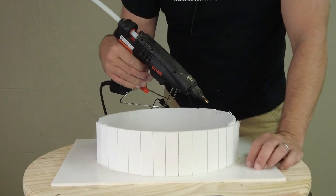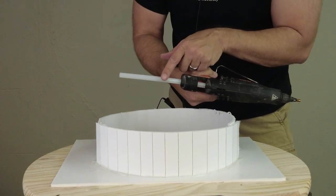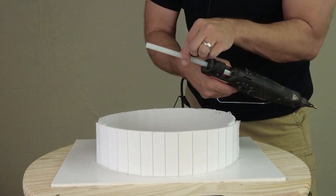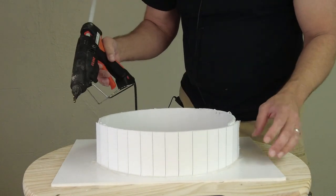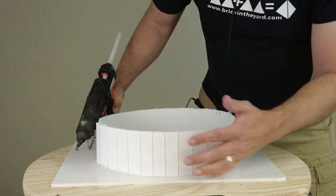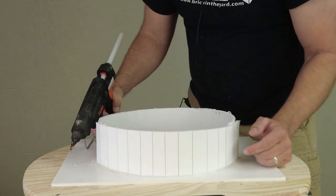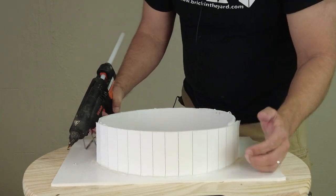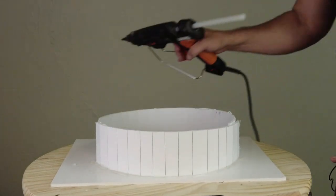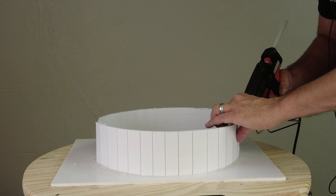One word about hot glue guns — every now and then you'll encounter hot glue sticks that inhibit platinum silicone. I've only recently run into that, but something to be aware of; when in doubt, run a test. That's another reason why, even though I'm not using platinum silicone here, I seal on the outside of the box — mainly because it makes for a prettier mold, but also so platinum that's going to be in the mold isn't in direct contact with the hot glue. With tin-cure silicone being used here, it's not going to be a problem.